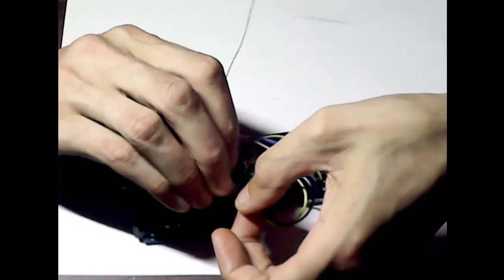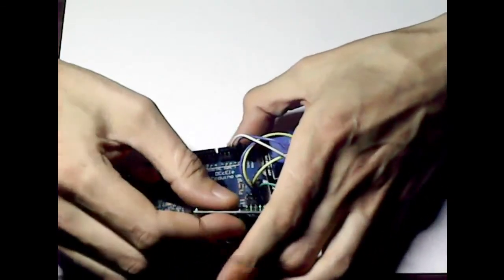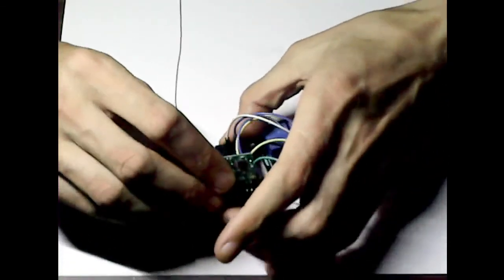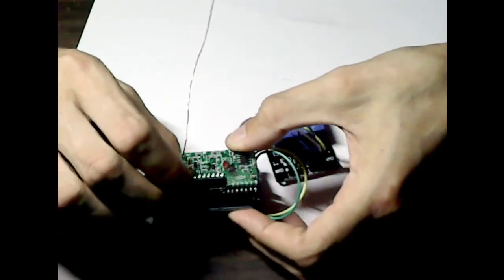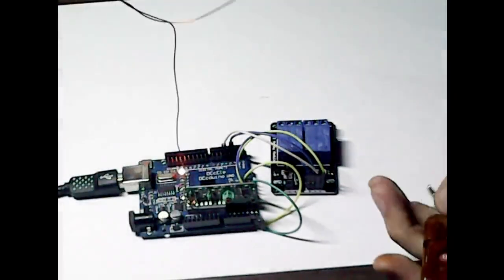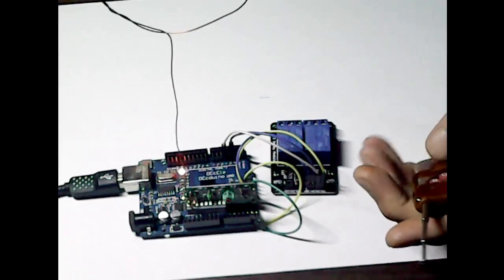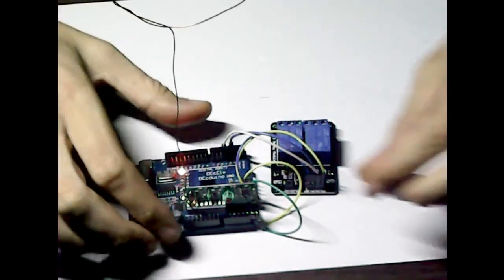It is there. I believe it's just in case you've got an LED light attached, so you can see the flicker rate. I don't know why you'd want to look at the flicker rate of the data being sent in. Pretty pointless, really. I suppose you could use the VT to detect the actual signal from the receiver itself. If you wanted to put down the data of the flashes, obviously it'd be sending some sort of code over the waves, and that VT pin would be a way of detecting the signal, because each one bleeps out a different code. So I'd imagine that'd affect the data that's coming through, but I believe that's probably what it's there for. And like I say, most people just string them to LEDs or don't use them at all.